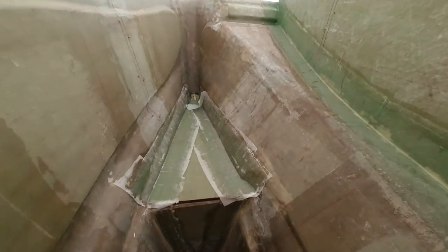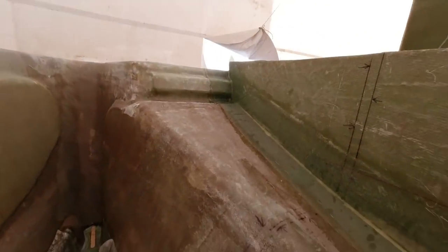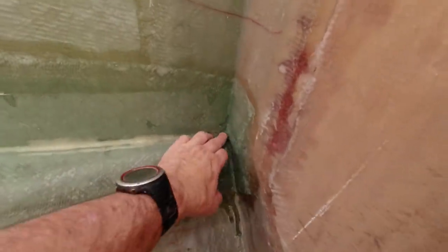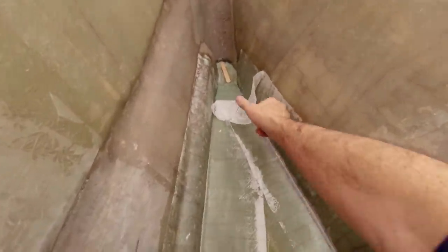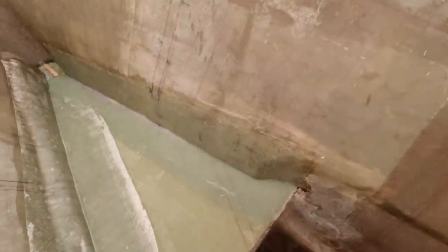All right, it's time to put this bulkhead in place. I have to lift this peel ply off. Yesterday I completed the tabbing on this wing frame here and that now has about nine layers of 600 double bias. And if anyone questions the strength of my bulkheads, I'll challenge them. That there is nine layers of glass as well as the layers of glass on the actual bulkhead itself. The crash bulkhead here has basically gone off and we've got a beautiful, beautiful fillet in there.